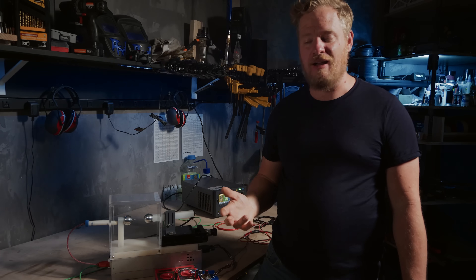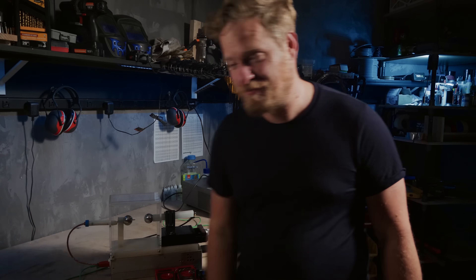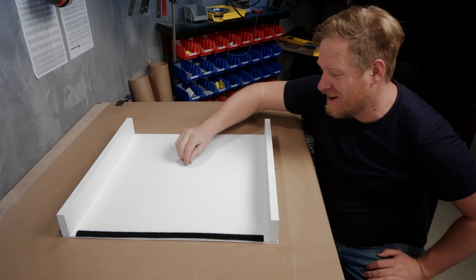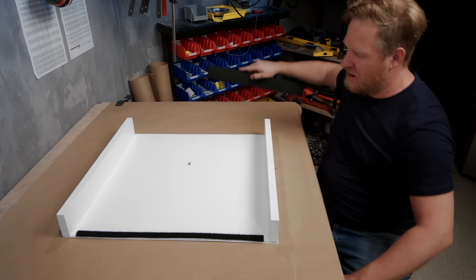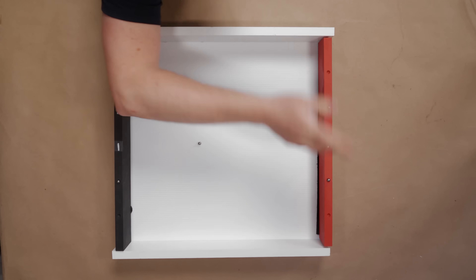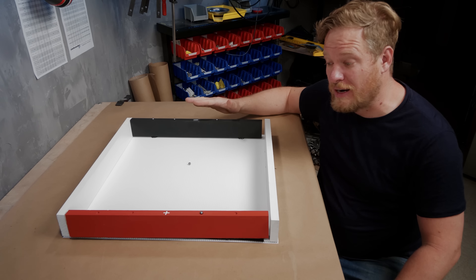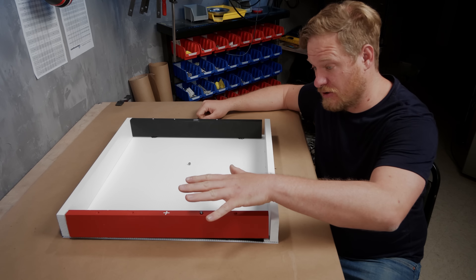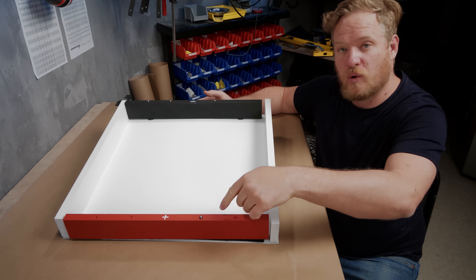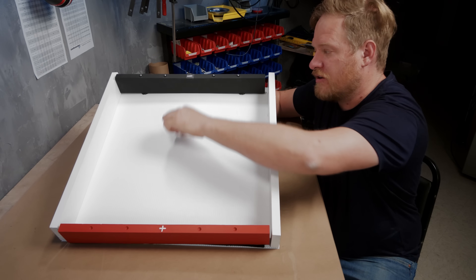But what's really happening here at an atomic level? My initial intuition about this was totally wrong, so I built another demo to explain. Let's talk about electric fields. This represents an electron — right now it's just sitting here, chilling. These represent two pieces of metal, both of which have some electrons moving freely within them. If we start moving electrons from one side to the other, creating a voltage difference — the side with too many electrons is the negative electrode, and the side with too few is the positive electrode. Electrons are repelled by negatively charged things and attracted to positively charged things, so our free-floating electron gets pulled towards the positive electrode. If we increase the voltage difference further, that electron goes faster and with more force.